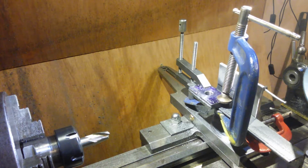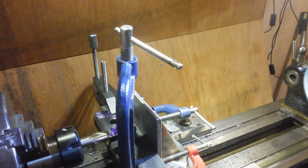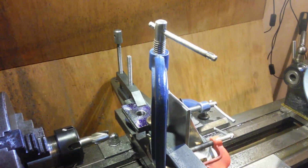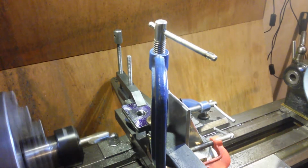I think we'll all agree it's best to make sure. So now I'm going to come in. That should be around about half a millimetre. It looks about a millimetre, half a millimetre up, I don't know. It looks a millimetre to me, but there we go. So we're going to put some oil in the bearings. Oil in the bearings for a start. Get a bit in there. We'll start it up, let it run for a couple of seconds. Oil in there now. You can see it oozing out. Touch it off and let it lock it. See what we get.